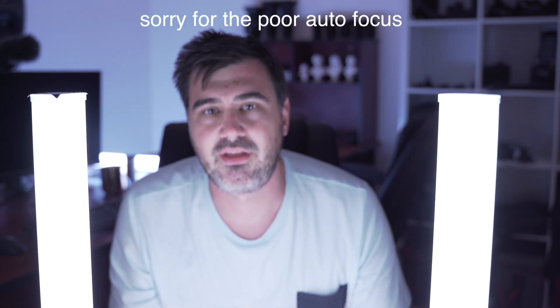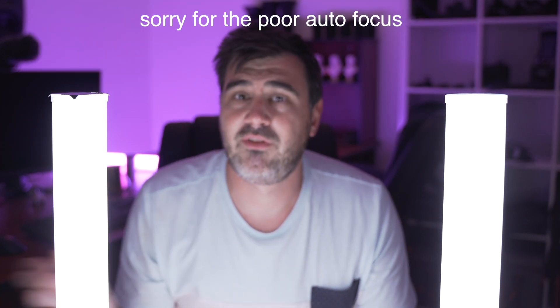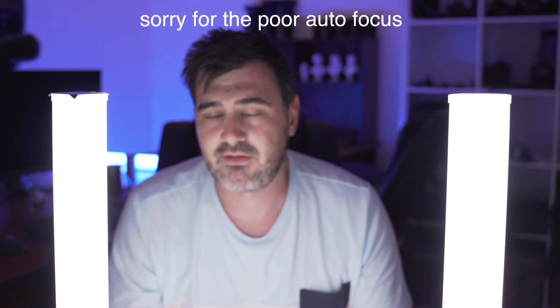These are the finished product LED tubes — they're pretty substantial and look quite nice. These ones in particular have 95 CRI color rendering score, which is basically very close to sunlight at 100 CRI. You get this cool remote that lets you dim up and down. I did have a problem with flickering when dimming, but the controller has a setting to change the PWM frequency. I switched from low PWM to high PWM and now they dim flawlessly with no flickering.